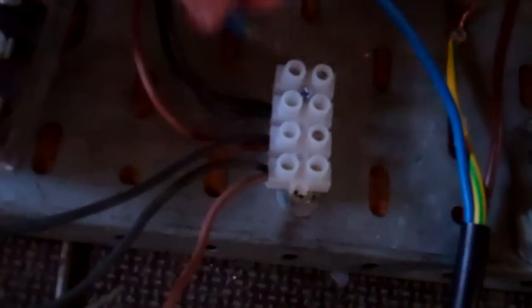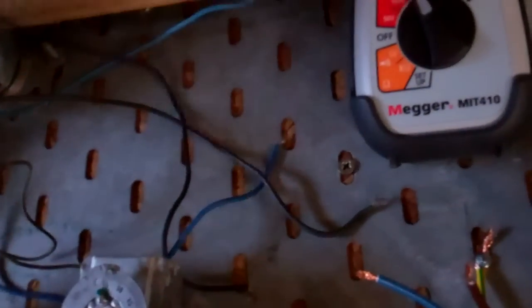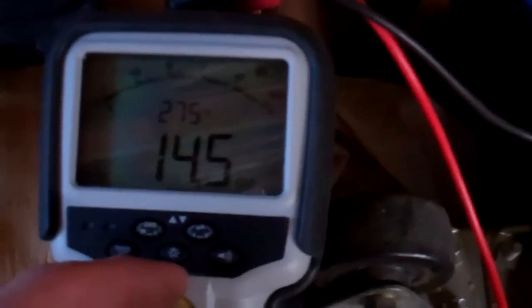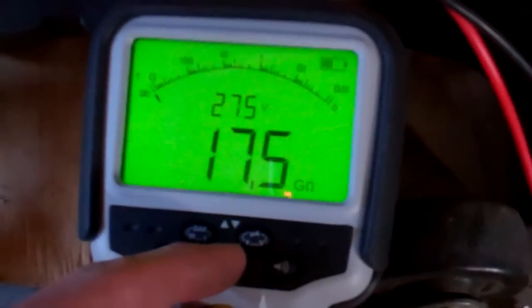Let's disconnect some wires. Here you can make a drawing of where these come, or label them, or if it's something you work on regularly you might be able to remember. So we've got that motor disconnected. Just got that little crocodile clip back on, so we're on one of the three wires. 13 giga ohms — well that's pretty good, 16. These have been sat out on the scrap motor pile outside so they could be a bit damp, but that one's OK.